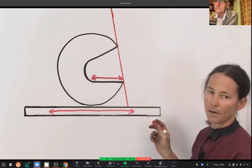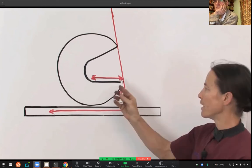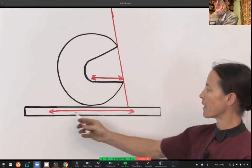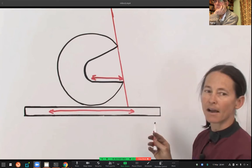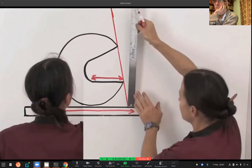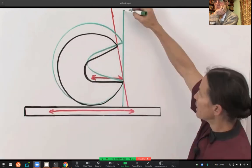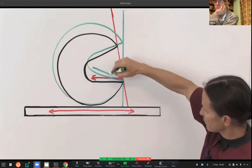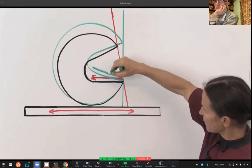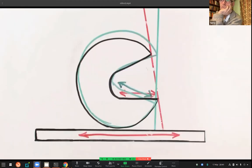You notice that the flute of the gouge is not in the fully closed position when the inside surface is parallel to the grinder platform. If I were to roll the gouge over until the flute were completely closed, in other words, for this line across the flute to be vertical, the inside surface of the flute would not be parallel to the grinder platform, and the bevel angle on the wing of the gouge would not be 40 degrees.